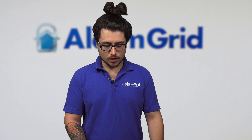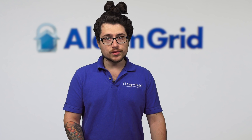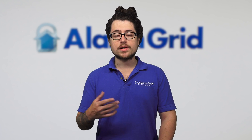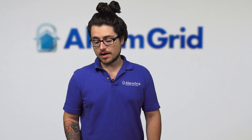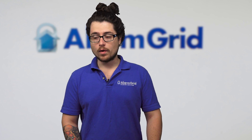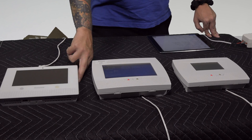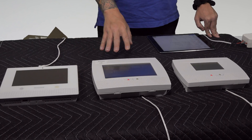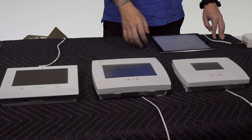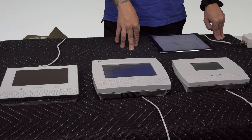Wi-Fi is used to send signal to an alarm company, central station, or your Total Connect application. For cell connectivity, the same idea applies — it's used for sending signals to applications and central stations. None of these panels has cell built in, so you need a cell module for each. The Lyric's cell module pops into the side of the panel, while the L7000 and L5210 require you to open the board, install and screw in the cell connector, then close the board.